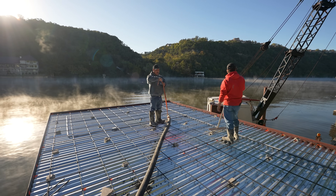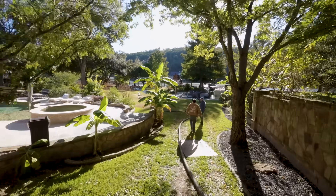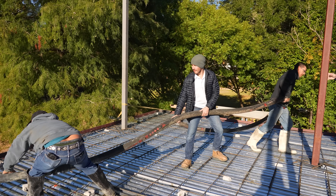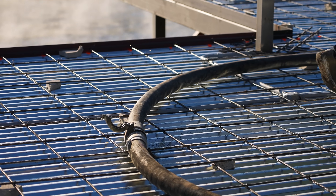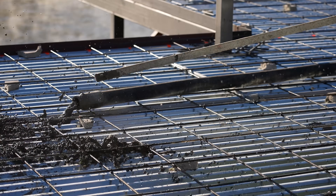Right as we were getting going, the line pump backed up and we were all biting our nails. These moments can be very tense. When you have this long of hose — each section is like 10 or 20 feet long, and we have 400 feet of hose — there are just so many instances where things can go wrong. If the aggregate in the concrete is a little bit thicker it can start clogging the pipe, and if it's clogged we are toast. All that concrete is literally just wasted. They were really clogged, smacking it with hammers, the pump was off. With all that pressure built up in the line they had to pop the collar off — boom goes the dynamite. Thankfully we did not have another clog for the rest of the day.